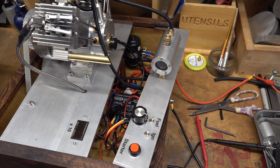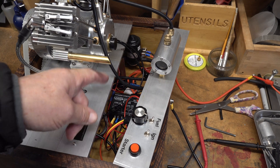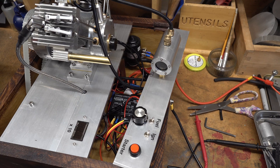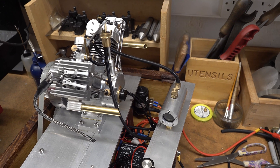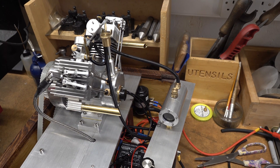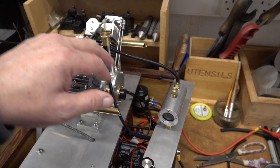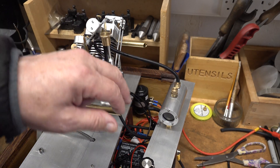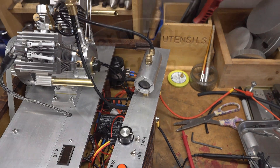To be honest, this setup for the pump is so complicated, and I don't like having wiring down there and the potential of fuel leaking out. I don't like admitting defeat, but what I've decided to do is rip it all out and just put a fuel tank in line with the carburettors - it's just a matter of putting some longer legs on here. Once I've done that I'll get back to you.